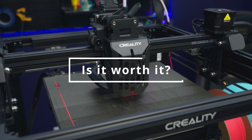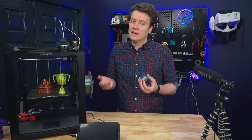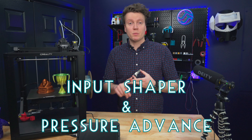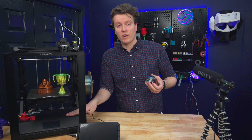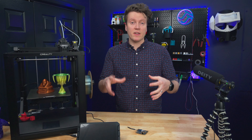Your next question should be: is it really worth it to install Klipper? Because your printer is already running Marlin and already printing — this takes some effort and cost. The two big headline features people always go back to are input shaper and pressure advance. Since you've got this separate computer doing all the mathematical computations and sending only the G-code directly over to the microcontroller, you can do some pretty advanced things.